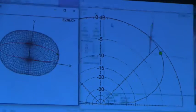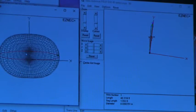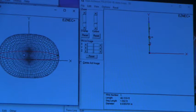The pattern you see is pretty much like you saw from a dipole up much higher. The top of this was probably 40 foot, the bottom of it 10 foot off the ground. But beautiful, no SWR across the band, and they just work. They're really simple to pull up, probably simpler than a vertical where you have to pull the ground radials. If you've got one band you want to work, you can take that sheet I gave you. The lengths on that sheet for all those antennas are probably just a little bit long, and you would have to trim them down, but that's better than cutting the wire too short and having to add some to it. So it's a good starting point.